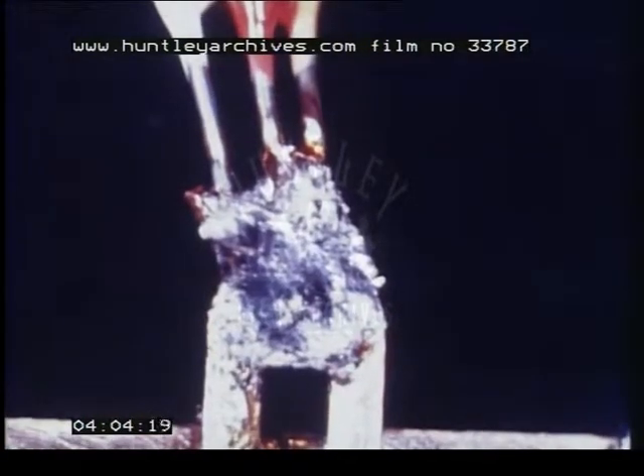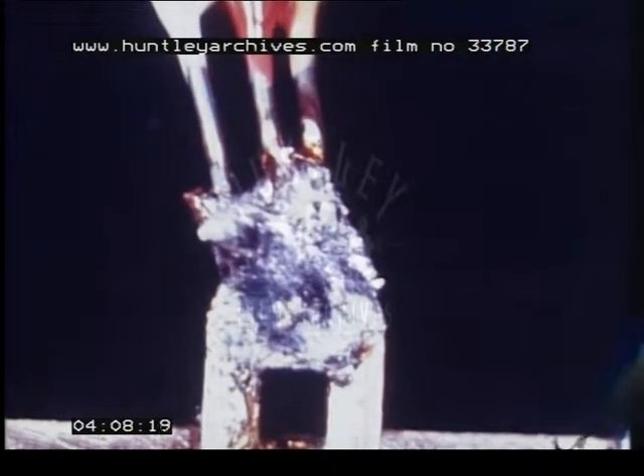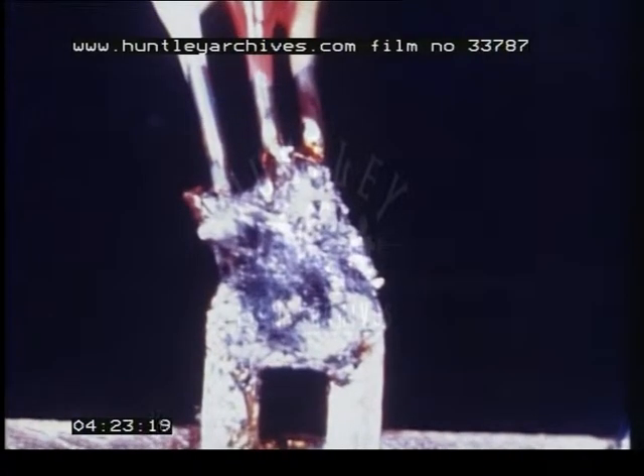If heating is carried out too long or too hot an iron is employed, the flux evaporates and the solder burns. This is shown by the grey colour and the rough surface. Moreover, burnt joints frequently show an upright ridge or point. The joints are not strong enough and after some time lose their electrical conductivity.